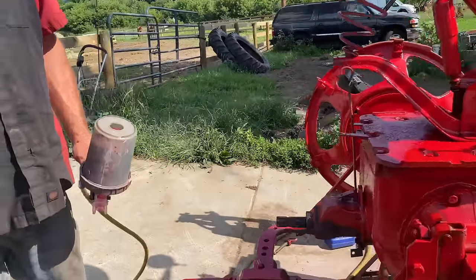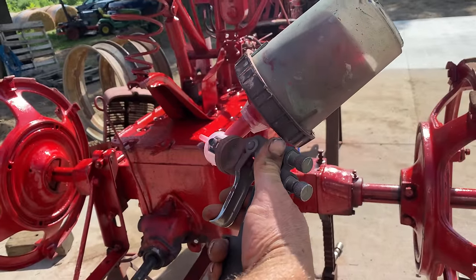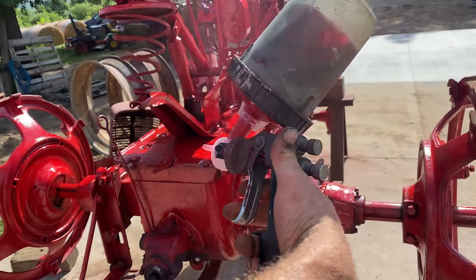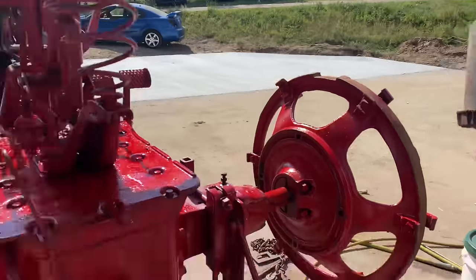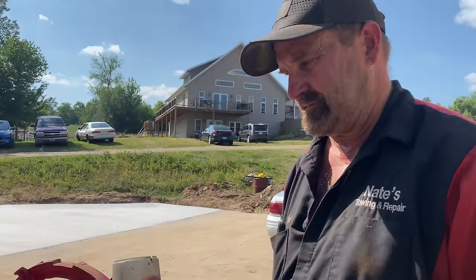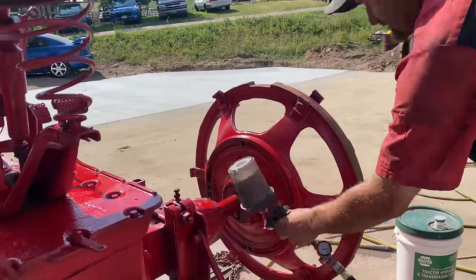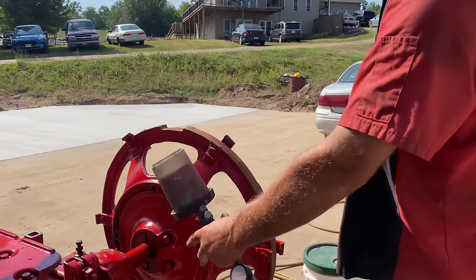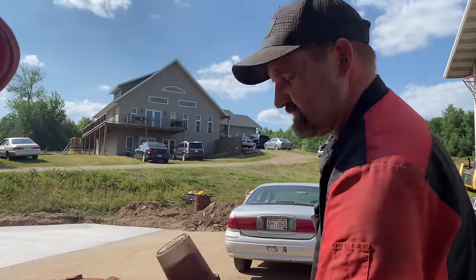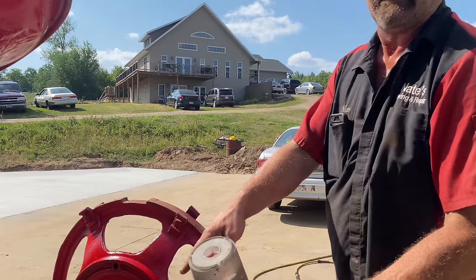So why do you turn it on and off? Stop and start, stop and, you know? Oh, the trigger. If you just pull that, it just puts air out. Paint. It's like a two-stage thing. No, that's my question. Most people take a spray can and just constant spray. How come you do a little bit? Well, when you come to the end of your stroke, you quit spraying, and then you're always moving the gun. If you stop and move again, you'll have a run.